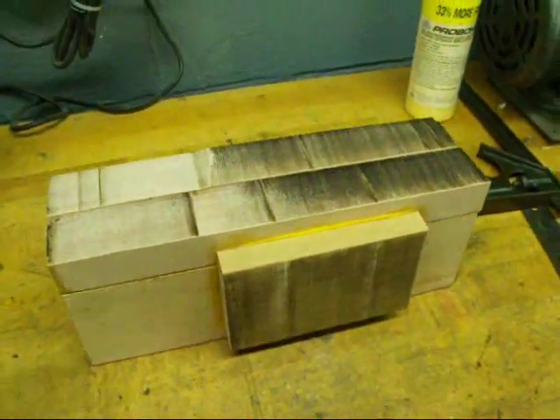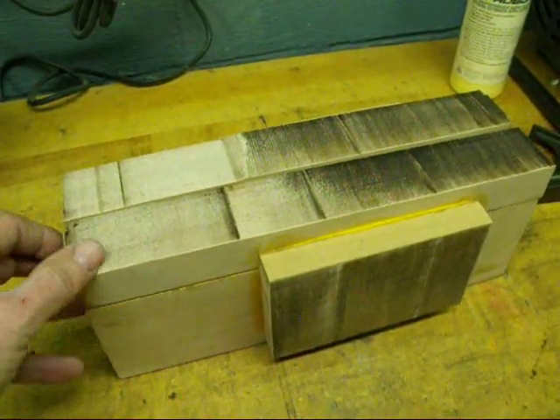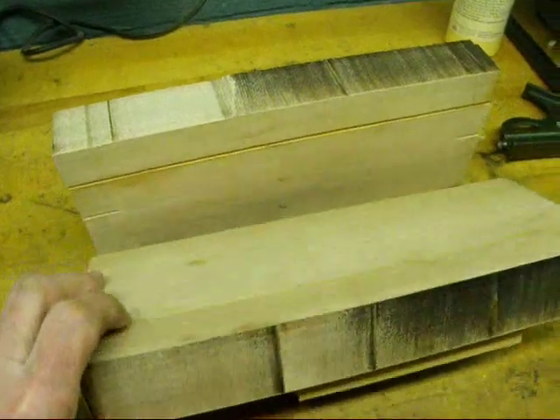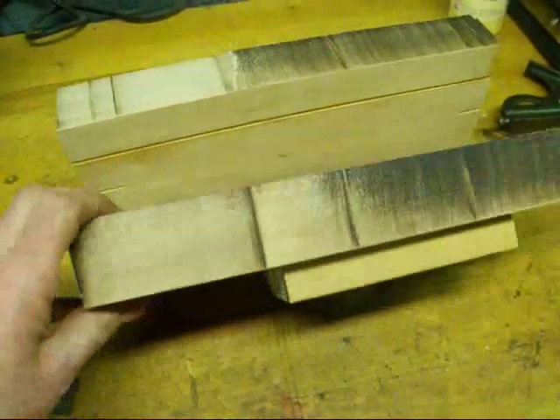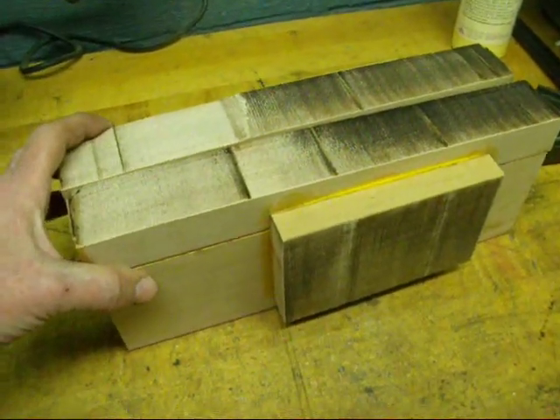This pattern will be primarily a turning exercise on the lathe. I use my metal lathe for wood, that's why I made it out of maple. I'm making this pattern out of maple because maple turns so beautifully on a lathe — it's just so hard and nice and it doesn't splinter.